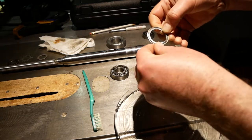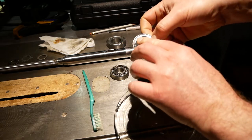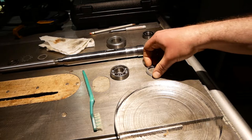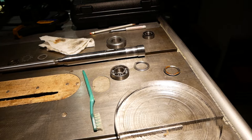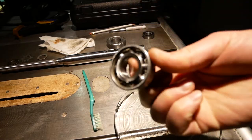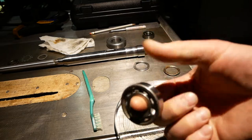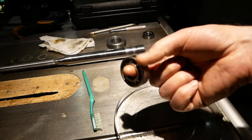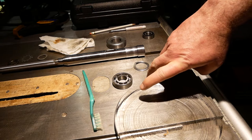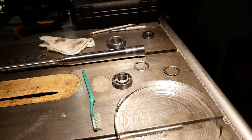Just for FYI if anybody wants to know about these folks — it says on here Romania, and right there it says URB. So whoever that Romanian bearing manufacturer URB is, all I'm going to say is your QA wasn't very good, because this bearing clearly went through your system, came out the other side, wasn't greased well, and the balls were just pitted straight from the factory. This didn't fail in use — it failed before it ever got out the door. It's crunchy, the balls are clearly not running smooth. That was just a shitty bearing that walked right out your door without being properly tested. There's absolutely no evidence of metal wear on my plate — just a little tiny speck.